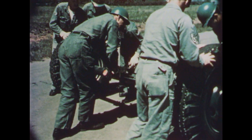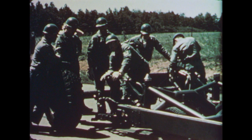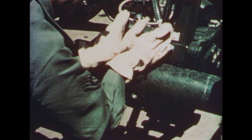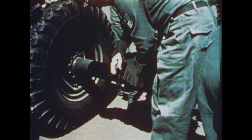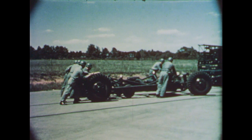The rear axle assembly is being mated to the transporter to enable towing from the launch area. The rear axle arms are actuated by manually operated hand pumps. Clamping surfaces are machined to assure accuracy of alignment. After the wheels are secured, the hydraulic jacks will raise the chassis to proper towing position. The wheels are secured to the axle by the clamp bolt.